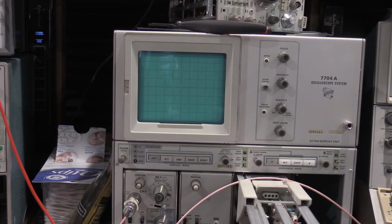Okay, we have yet another weirdness. I checked the parts list. It turns out C423 is, in this serial number, a fixed capacitor, so there's nothing to adjust. Starting in serial number B230,000, it went to a variable, but in this case it's fixed, so nothing to adjust in step 6.